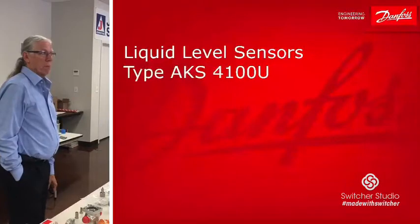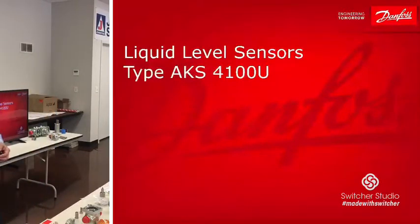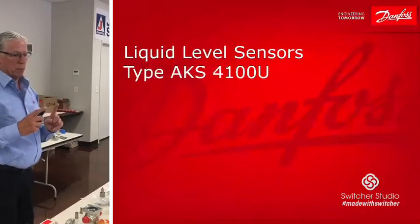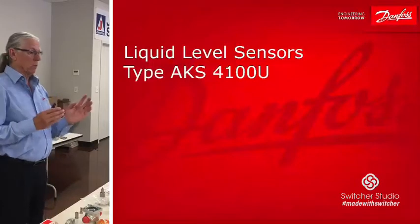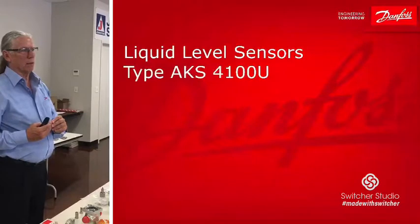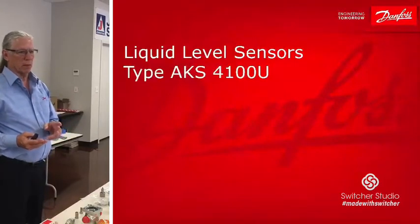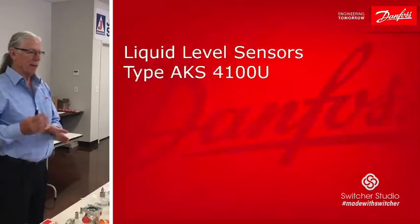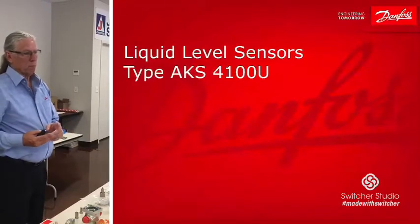So what's supposed to happen is, well, it's got a range that it can operate with. It's like the IK motor, it's 24 volts DC, so it's not the same. I think that's the one I was getting confused, I think, on the level sensor, I believe that's the one that's 14 to something, 14 to 30 that it needs to be. I'm almost positive that's what, and then the AC component of the DC can't be any more than 5 volts.